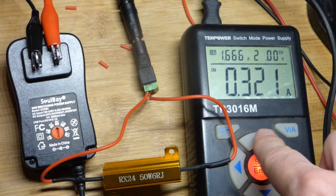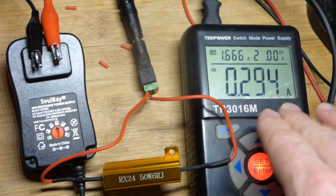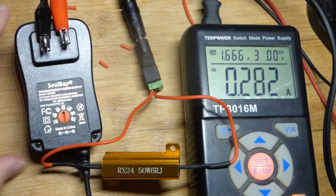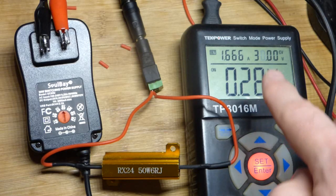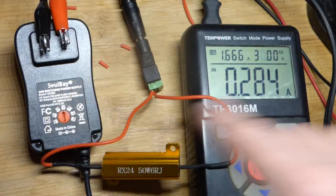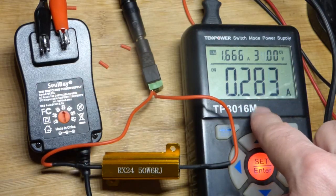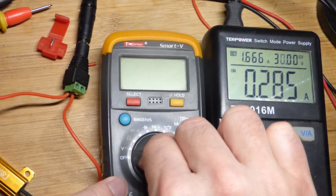As we raise the voltage to 27, 28 volts, we need less and less current — it's converting power. If conversion were perfect, at 24 volts input we'd need 0.25 amps to supply 6 volts at 1 amp (with the 6-ohm load), or at 12 volts input we'd need 0.5 amps. But it's not a perfect conversion.